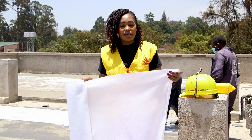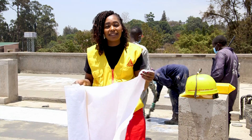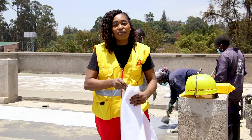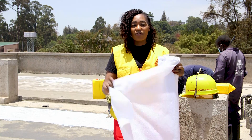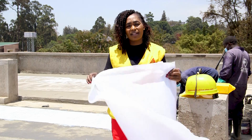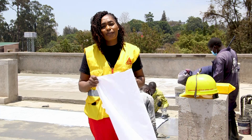What I'm using today is categorized by density. This is 110 GSM — GSM means grams per square meter. We have others that are lower than this grading, and others that are heavier, depending on the kind of work you are doing. But for us today, on the roof work that we are going to do, this is more ideal: 110 GSM, meaning grams per square meter.